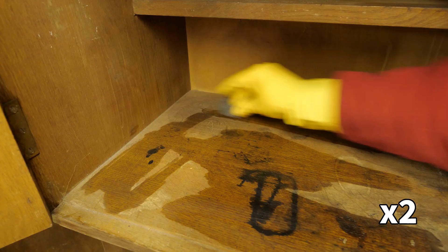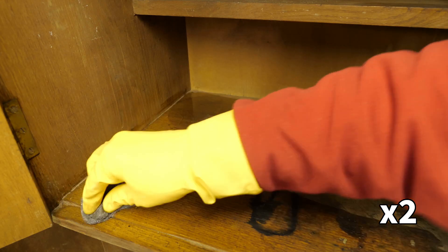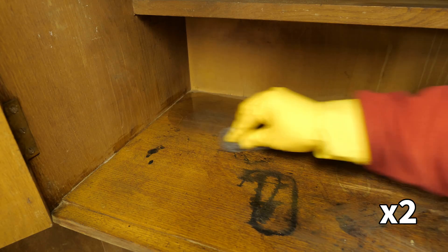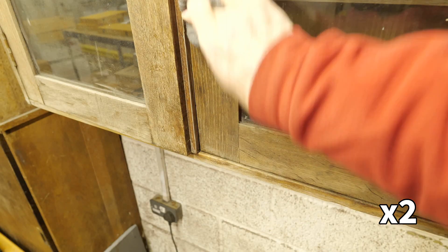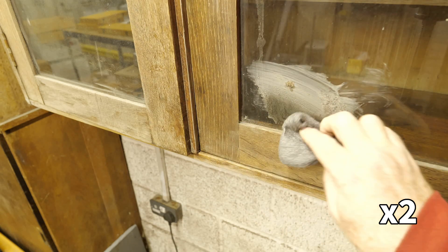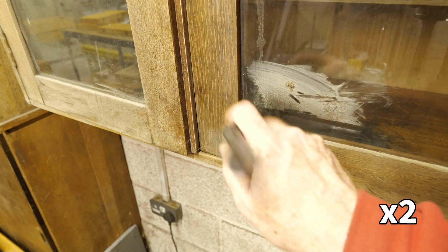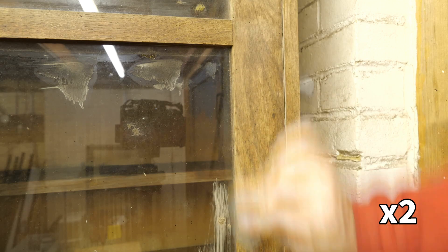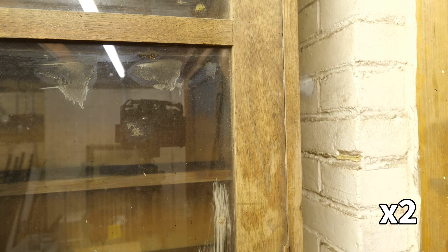On the inside of the cabinet there have been a lot of mystery spillages, but the alcohol seems to be able to clear many of them up. Some are clearly stained deep into the wood, so can't be cleared by a surface rub down, but they aren't really a problem for what I have in mind for this cabinet — I just want to make sure my measurement tools don't get dirty. The alcohol leaves behind a dry residue which needs to be cleaned off by rubbing down with more fine wire wool, then the dust is brushed away. The surface left behind is much cleaner, and each rub down with the wire wool has helped smooth any roughness. Any loose or damaged finish has been removed.